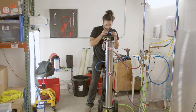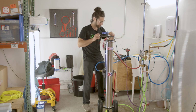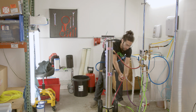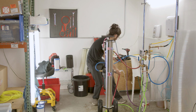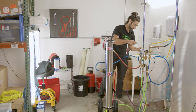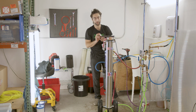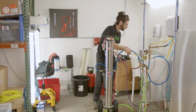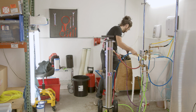Now it's not 0. That's what our third stage of filtration is for. Resin, the final cleanup. To verify, let's check the second meter. Second reader's around 9. Still close. Now, final stage of purification comes out of the resin chamber.